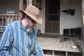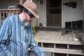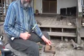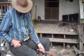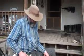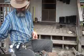When you're straightening one of these, you're going to need a heavy-duty block of wood and a ball peen hammer. Simply find the high points, set down your anvil or your cutter, and whack it wherever it's high. You have to whack it hard. You can't do it like I just did. And in fact, if you've got a big bend in it, you actually need to have 2 pieces of wood. Space them so that you've got a clearance underneath, and then whack it. And that's just the first part.